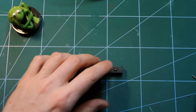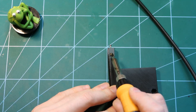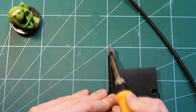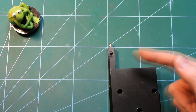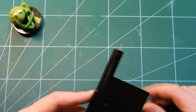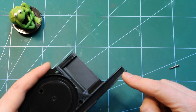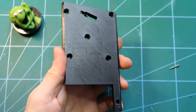Now the second side — exactly the same. There is the opening, so we throw the brass insert in, catch it with the screw, and warm it up a little pushing it inside. You can also melt the bump down — it makes no difference. When doing this, be sure not to breathe in the fumes — do it in a well-ventilated room. On this side it should not be deformed; make sure it is flat.